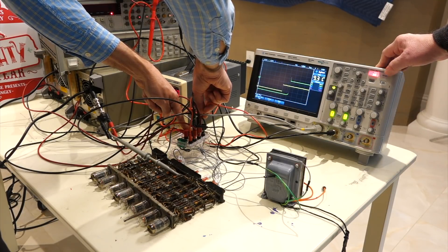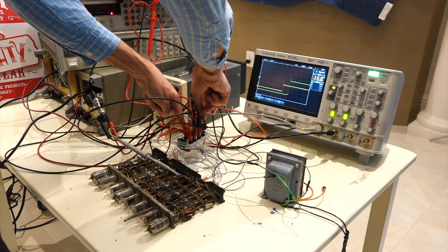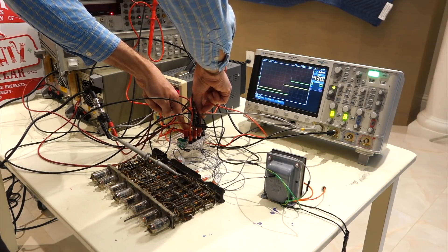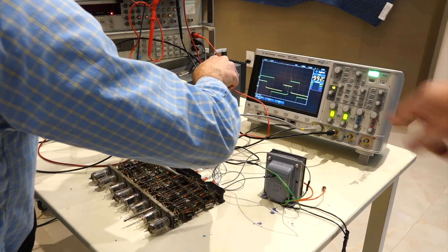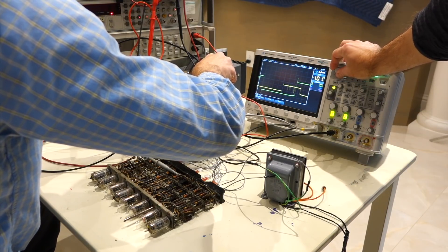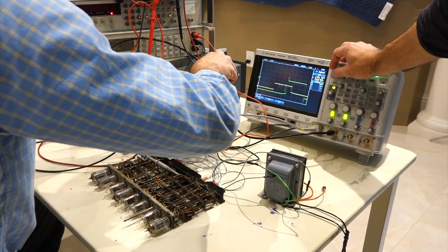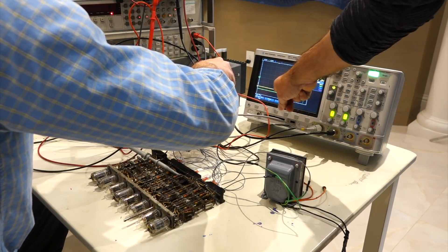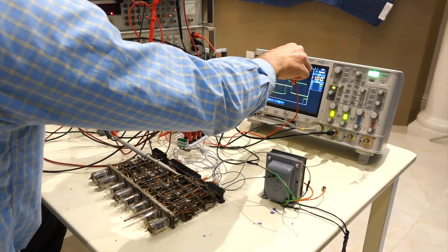Put it on auto, it will re-trigger. Put it on run. Just run? There you go. You got some intermediate bounce there. Which is still good. That's a nice one. That's kind of a mess. No, that's superb. You have like a noisy bunch of pulses and it transformed it into a nice clean one. There you go. Here's your picture. Look at that. Your bounces are longer than the debounce interval, but it was not annoyed by this nor by that. It made a clean output. There's a little bit of noise, but...